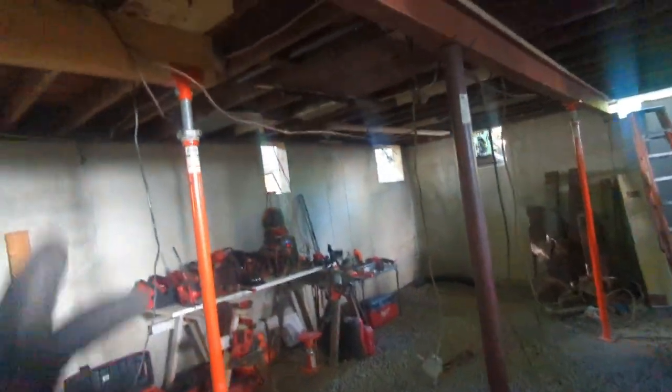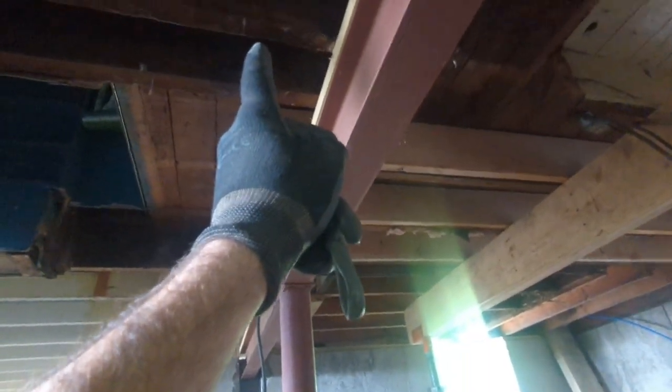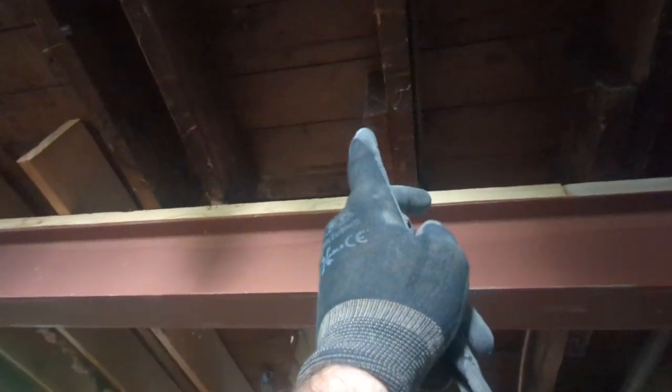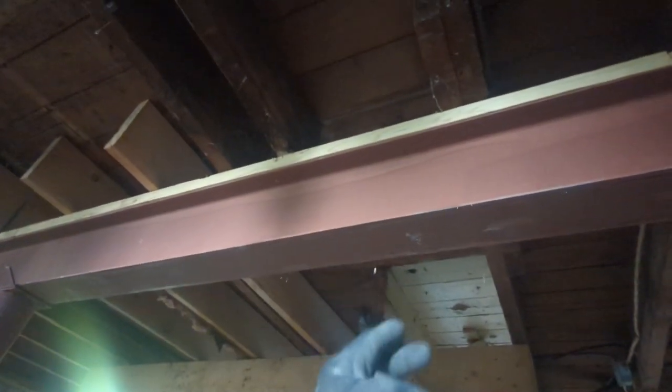And so then the fourth one is for this shorty here. The problem with that is directly lined to sister onto that side, to our side of it, like we've done on all of these, slams right into the end of this joist. Because all the joists on this side of the house are on the right-hand side, or the sister side, of the joist over there. So joist over there, we come to the right-hand side with the sister, and bang, we're right into the end of this joist.